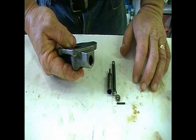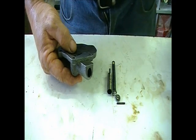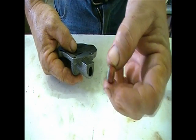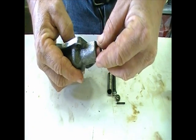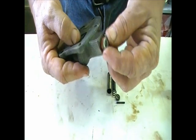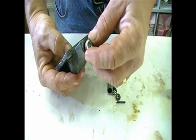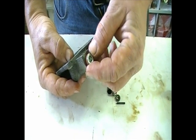So I thought I might ought to consider an alternative idea. My first thought was to take a small quarter-inch pipe plug and just thread the end of that to NPT and put it in and tighten it down. Obviously I have to drill a hole in there so it relieves the pressure, but that's good.